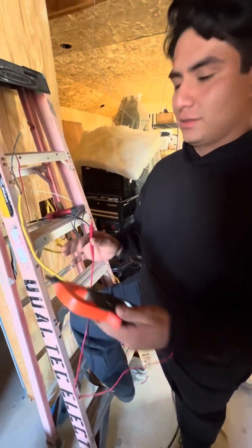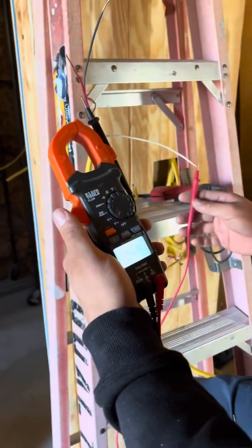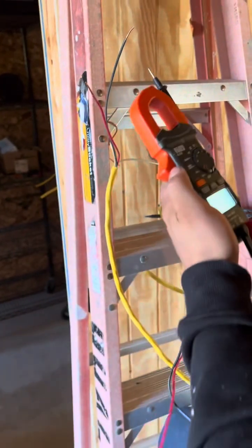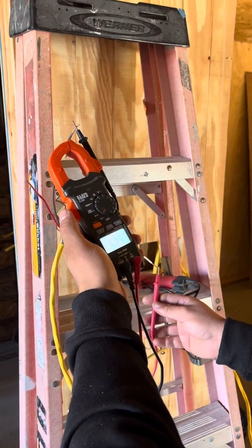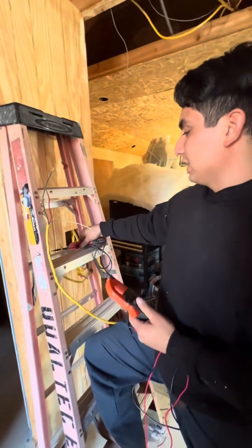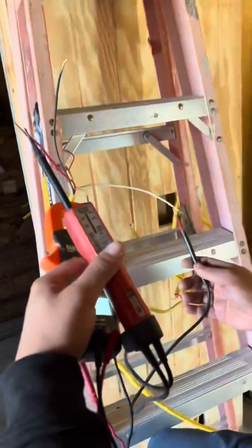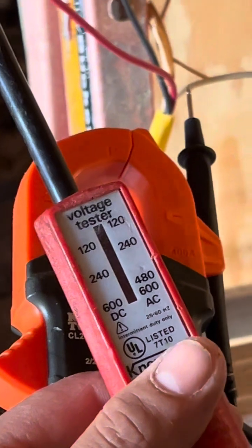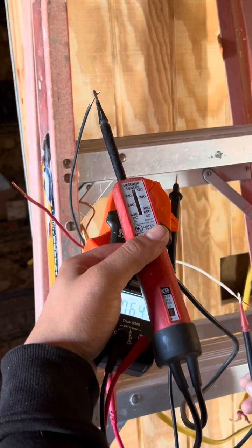Check it out — I'm using a voltage meter right now and I'm getting 120 volts to red, but neutral to black I'm getting 63 volts, kind of jumping around. We thought it was backfeeding and it was nicked. But using this old-school tester, we're seeing 120 volts on the tester, but we're getting nothing on the black.